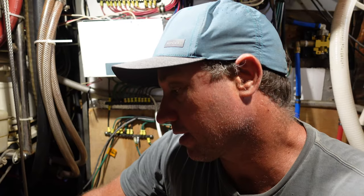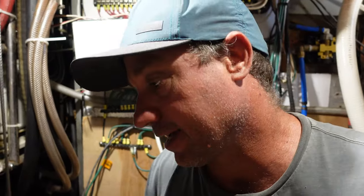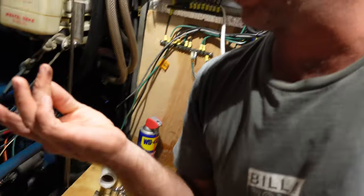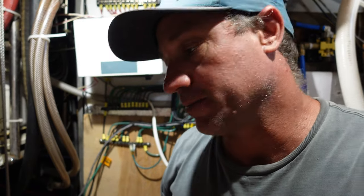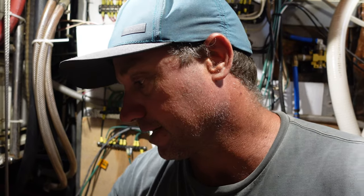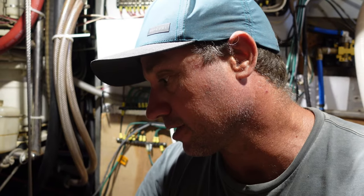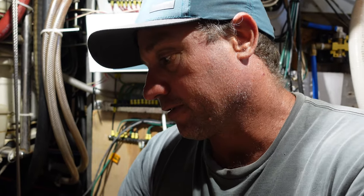Back in the engine room, and today I'm gonna take off the water pump, hop on the push bike, take it to the post office. So as I said, I went over the engine the other day and I put my finger underneath here. There was a slight bit of oil, not a lot, but enough to say, you know what, we don't need problems later on down the track. The pump's not damaged, so I'm gonna get the pump rebuilt, which will involve new bearings, new seals, and a little bit of peace of mind for quite some time. When we leave, we'd like to have a spare one, but if it's not in the budget, at least we'll be leaving with one that's been rebuilt with new bearings, new seals, new impeller.